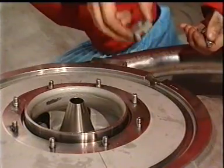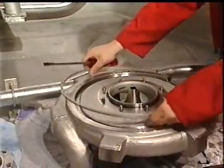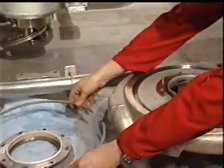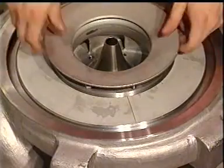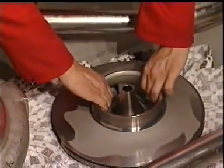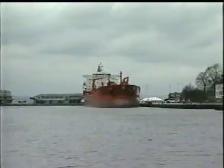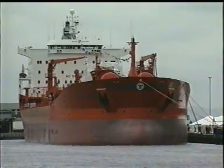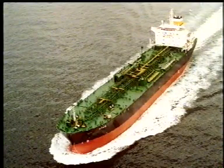Loosen the locking bracket and remove the locking ring. Use the suction bell mouth to lift out the suction cover, and finally lift up the pump impeller. Changing of wear rings is a service job normally done by the crew on board. How frequently depends primarily on type of cargo — some ships discharging cargo with a lot of sediment may do this job several times per year, while others carrying only clean oil products may run 5 to 10 years before doing any service work on the cargo pump.